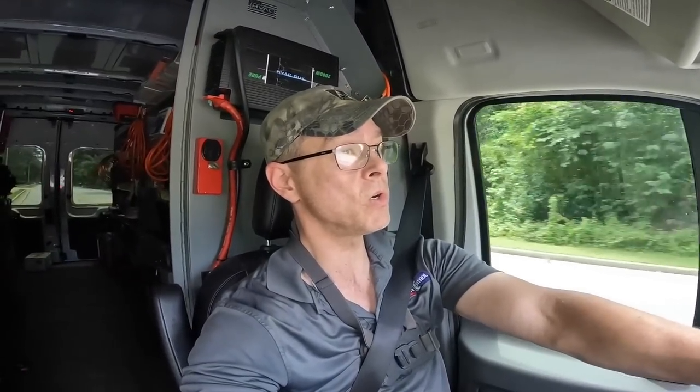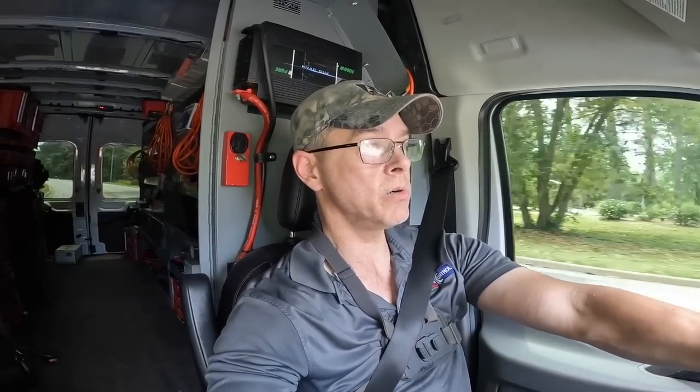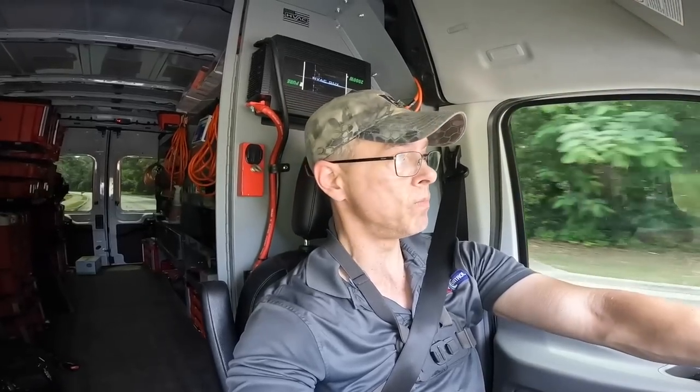Well, guys, I was very clear with that homeowner. If I gotta add a hard start kit to it, that's never good. That means that compressor needs help. So he knows he may be looking at a replacement, but I also told him this thing could last another 10 years. Just keep an eye on it, prepare for the worst, and hope for the best.